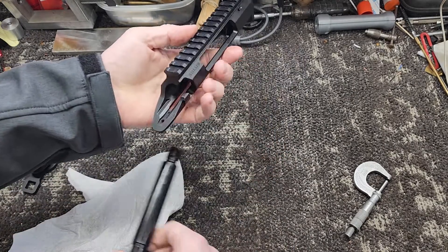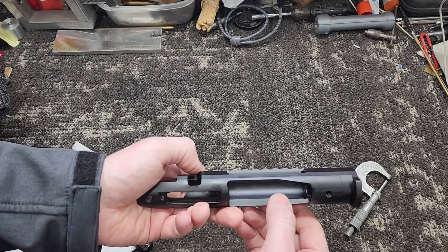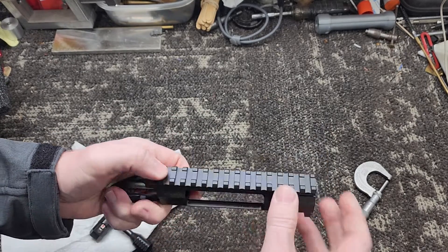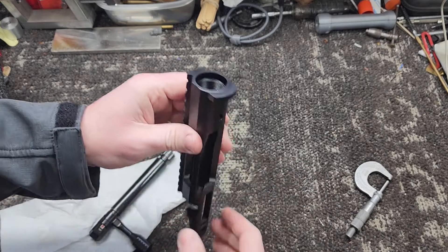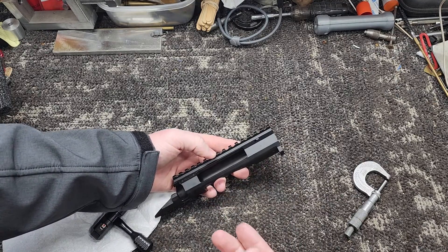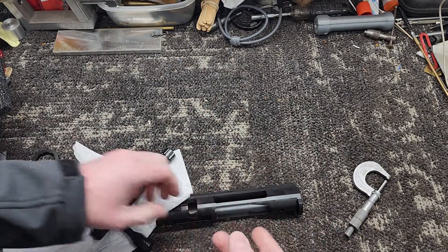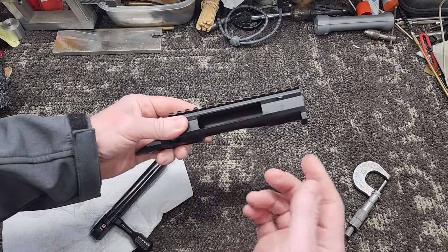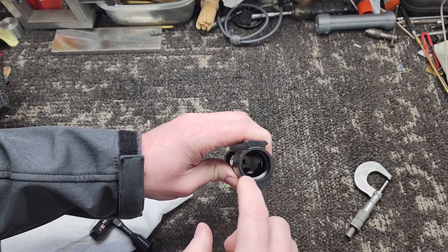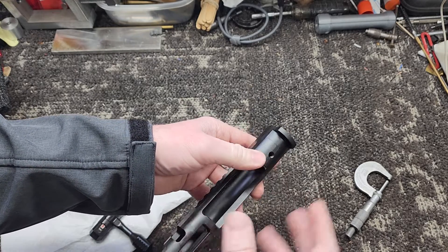This rail looks fine to me — most modern bases will fit right into this guy. I noticed it is scalloped on the bottom there, but most of your 1913 Picatinny rail stuff should fit on there without an issue. As far as the builder's aspect of this, these things are designed — the primary goal, I think — to make an action that you can buy a barrel, pre-threaded, pre-chambered, screw it on, and you've got whatever you want. I tend to shoulder barrels a lot, so I'm going to stick this thing on the lathe in the next video, and we're going to true it up and check how true it is.